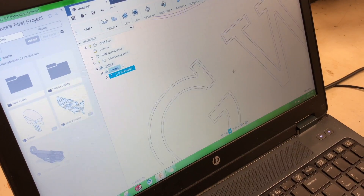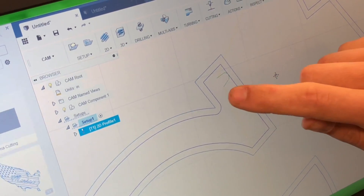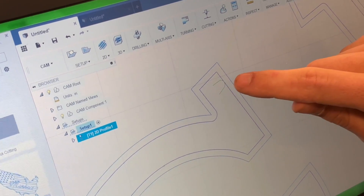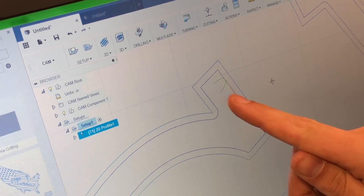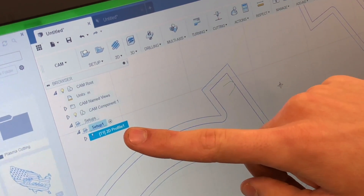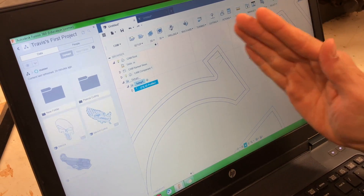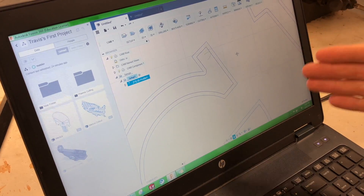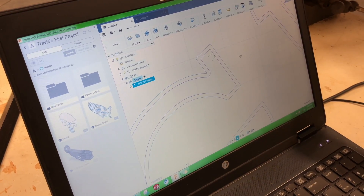For example, this one right here — if I zoom out, it's the letter G. The green is where my cutter's going to start, come in, do all the profile, and lead out. The outside profile right here is the geometry that I actually modeled, so it's going to cut this inside edge all the way around. This offset is determined by what I put in my 2D cutting profile — it's only about 30 thousandths offset. I always put a little offset just to account for if I want to sand the edge a little bit.